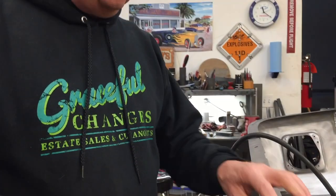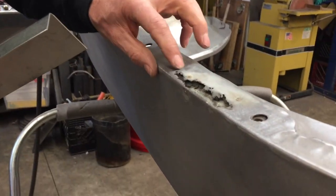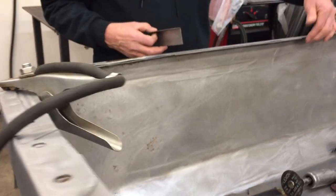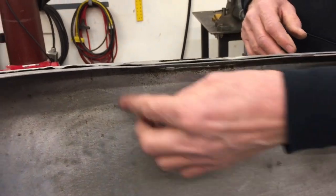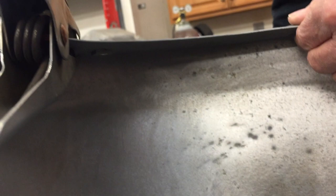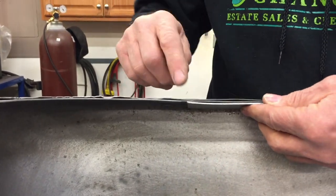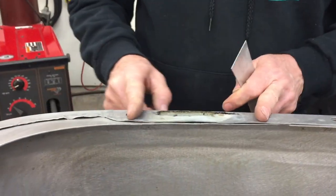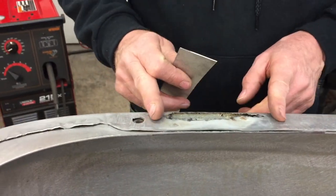The first thing I got to do is cut away this top part here. There's a reinforcing panel underneath that goes all the way along the fender front to back, and it has threaded nutserts where you bolt the fenders onto the bed — that's rusted all the way through also. I made a little piece for that too. I want to be able to cut through to see how far I have to go. When you're working on these trucks, it's best to keep as much of the original sheet metal as possible — I just want to replace what I need to, nothing more and nothing less.